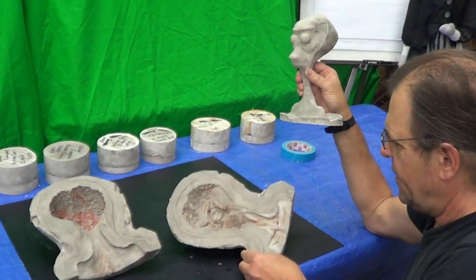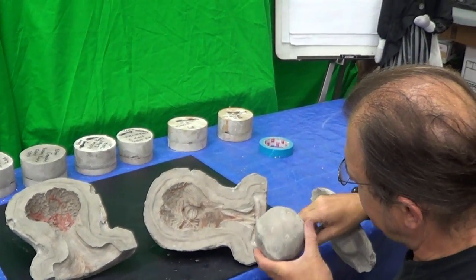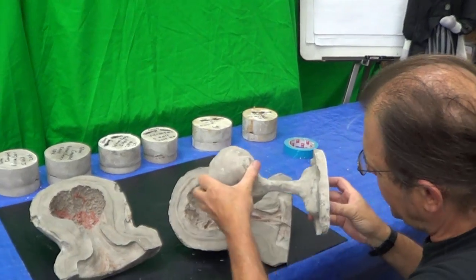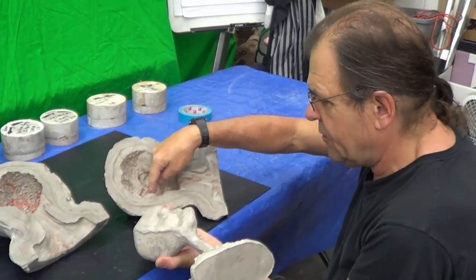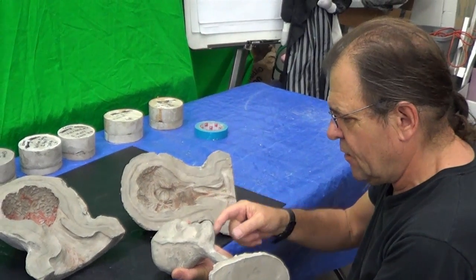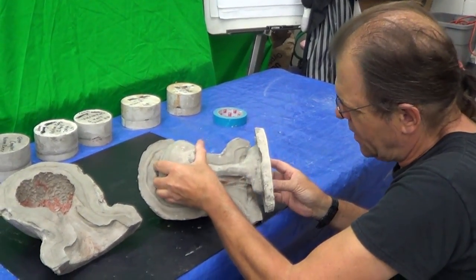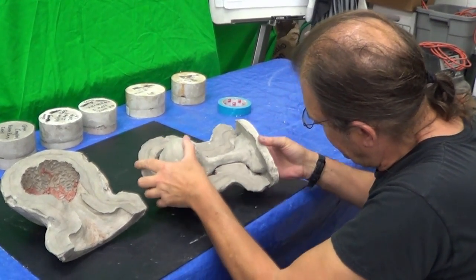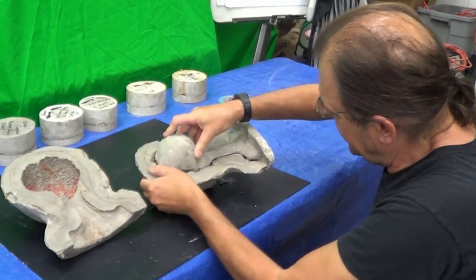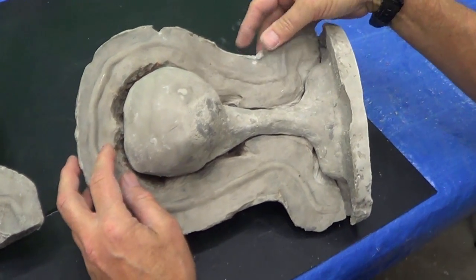We're going to put the silicone skin material in there, right? Okay? And then we're going to drop this down. Now these two round guys there register right against those, and this line right here registers against this line right here, which is the parting of the mouth. And it fits in there rather well. Doesn't move. And you can see the displacement now that I've been talking about.